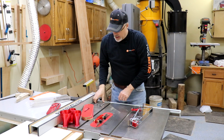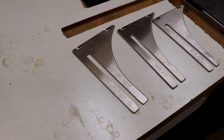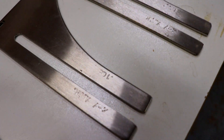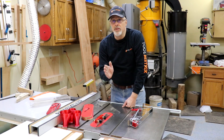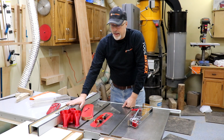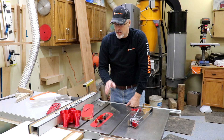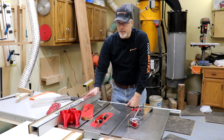It's a high quality splitter and it comes in three splitter thickness options — you choose one that matches the thickness of the blade you're using. You can also use the thinner splitter and align it to the fence side of the blade, so it doesn't have to be the exact thickness of the blade if you do it that way. That's the way I have it set up — my splitter is a little bit thinner than the blade and I just have it aligned perfectly to the right side of the blade.